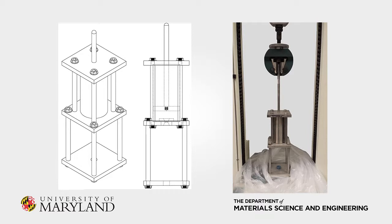The apparatus that we designed consists of a hopper or chamber held between a center plate with an interchangeable orifice die, and a top plate with a ram. Concrete is loaded into the hopper, and the top plate is reattached before extrusion can begin. The entire apparatus can easily be disassembled for cleaning between test runs, and the parts that contact fresh concrete are made from stainless steel to prevent corrosion.